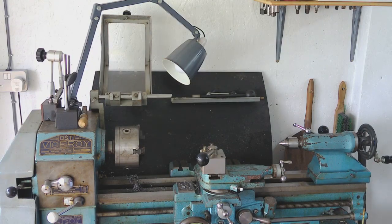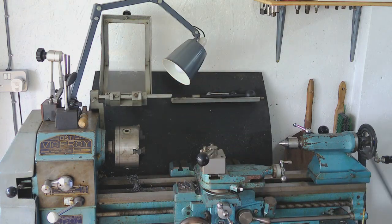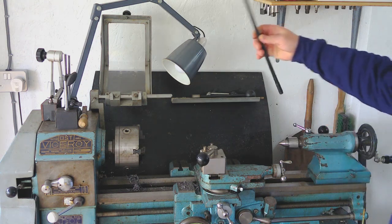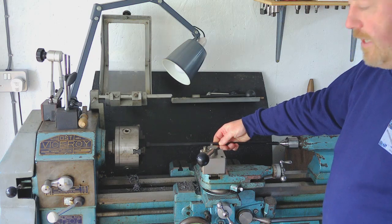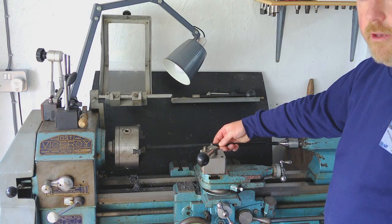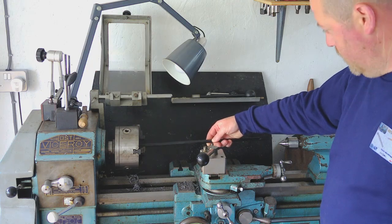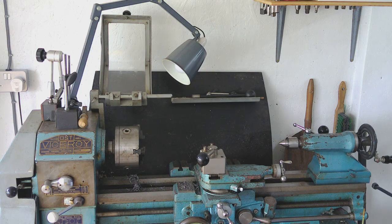And just to show you what I'm talking about, guys, here's the existing drawbar at full length. I've wound my tailstock back as far as it'll go. In fact, it's slightly hanging off the edge of the bed there. I've put my revolving centre in, and if I stick this in there, you can see that's flush with the chuck. Now, I don't need all of that because I'm going to be gripping on the 25mm threaded section that's going to become the M16 thread. So I have got another 25mm of play in there, which is about 25mm that's hanging over the back of the tailstock, off the back of the bed there. So it is going to be at full capacity of the lathe. So it'll be an interesting project.